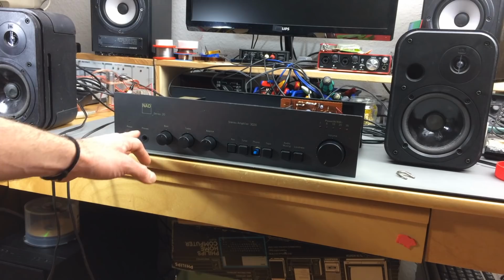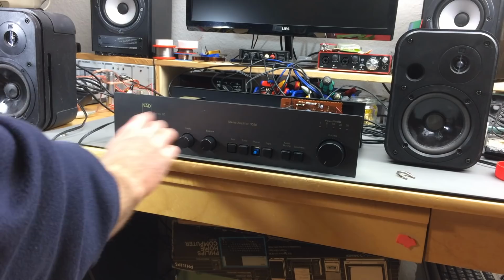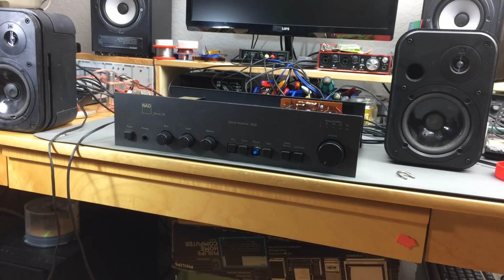Okay, switching on. Yep, and I have the same. Or basically, I have another hum issue here. That was clearly not the hum we had before with the preamp section in there. This was a 100 hertz hum, like a mains frequency hum. The mains frequency actually is at 50 hertz, but you get a 100 hertz hum from the mains if the filter capacitors are bad.